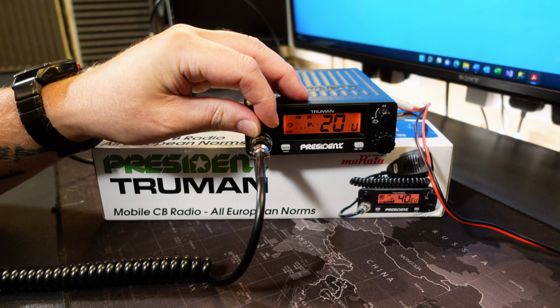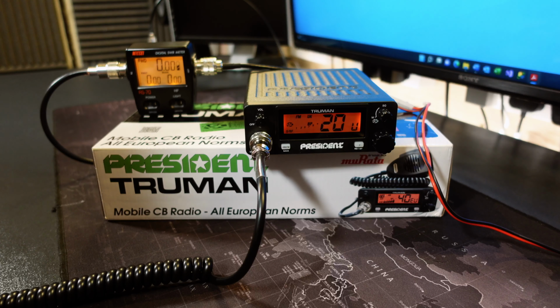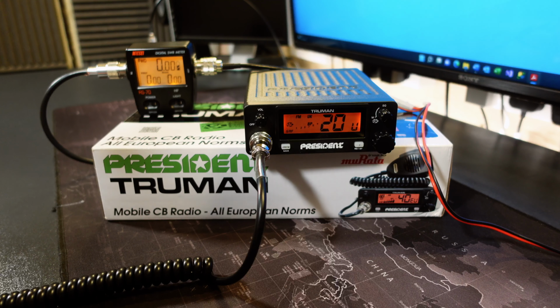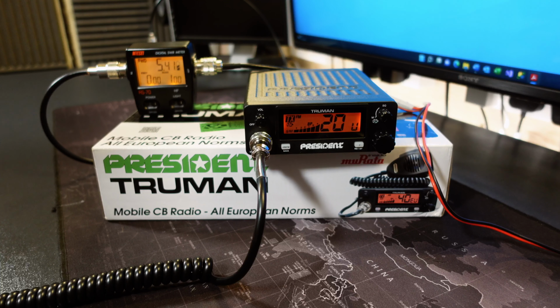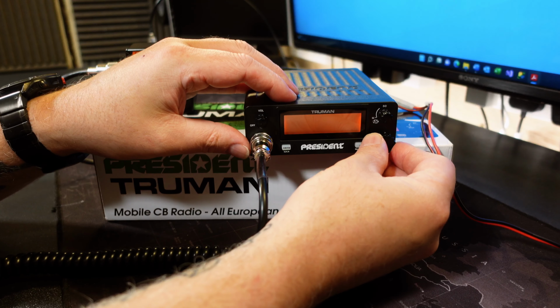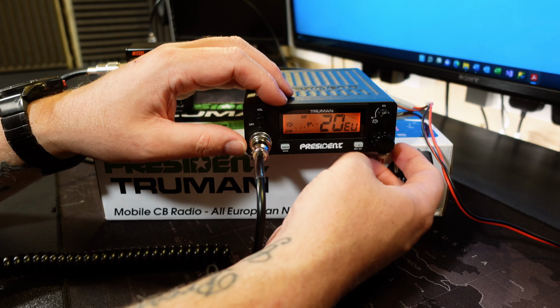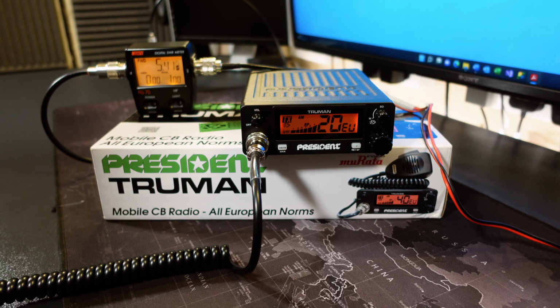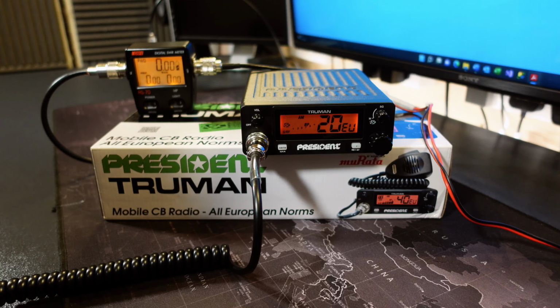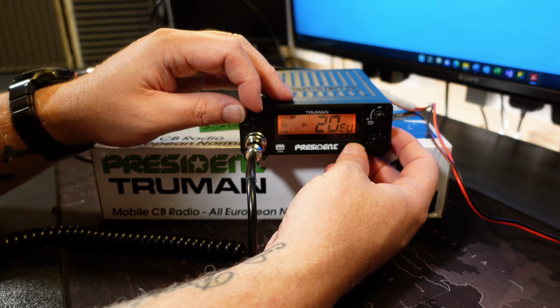Turn on the radio. So this is with the wire cut and the AM pot adjusted, but we're in UK mode, so we have no AM. Channel 20. And on FM UK, 5.56 watts, and FM, 5.39 watts. And let's just switch to EU, channel 20, in order to get AM. Let's just try that now. 5.41 watts on AM, and on FM, 5.41. So that's it. That concludes all of the power adjustments and the power settings.